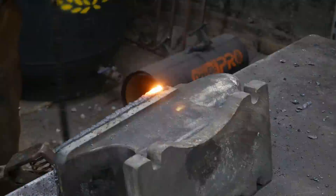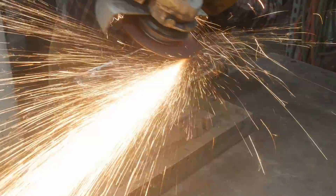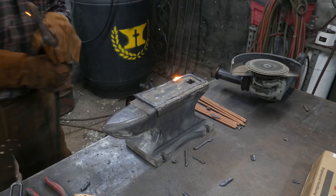In total I have about two pounds of welding rod into the face of this. About a pound - just a fuzz over a pound - of 6013 welding rods, and roughly a pound of hard facing rod. I could have done a double layer but I chose in this application to just do one singular layer to keep it as true to the original form as possible, plus there are some risks with going with a second layer.